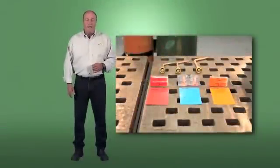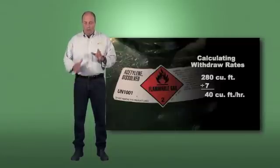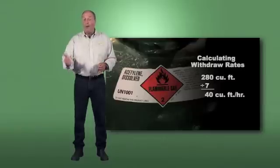If you don't have tip charts, ask your equipment supplier to help with recommended settings. Also remember the 1/7th rule for using acetylene — make sure you have adequate capacity from the acetylene cylinder to support the acetylene consumption of the tip you're using.